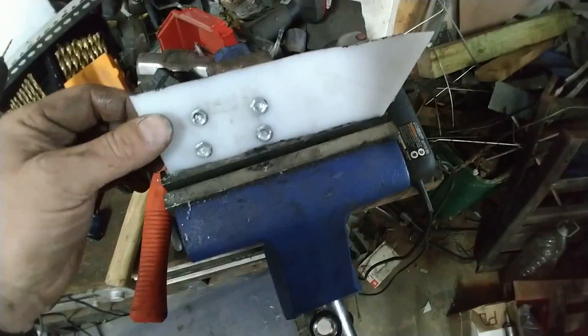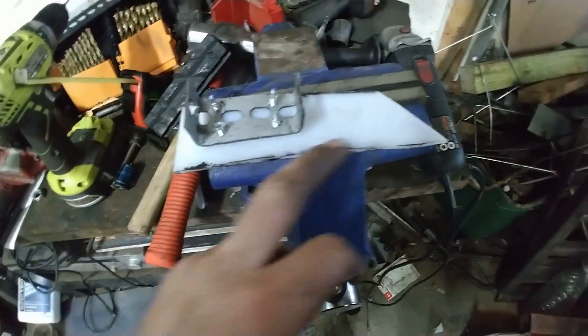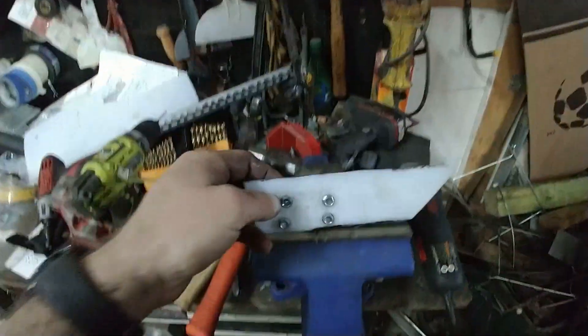Here is the scraper — it's going to be on the left hand side, scraping to the right. I put more material so I can trim it in place. I just drilled four holes and put those soft tapered screws there. This is going to be below the caliper.